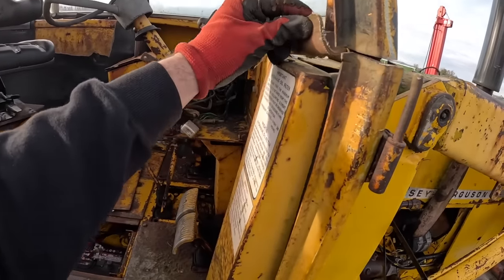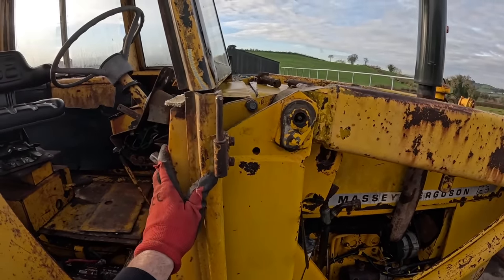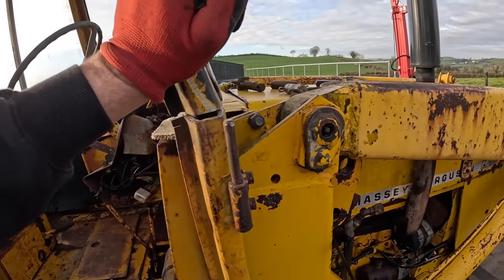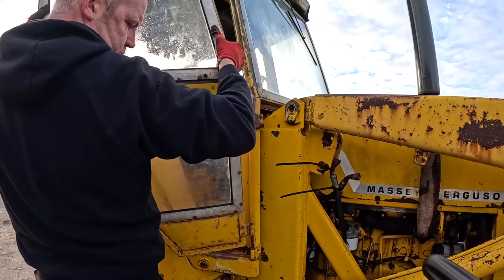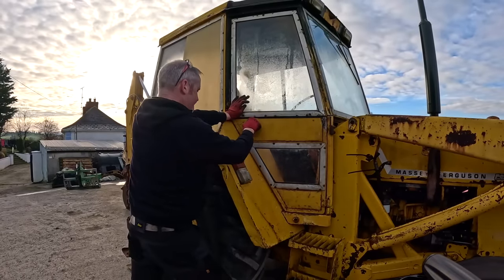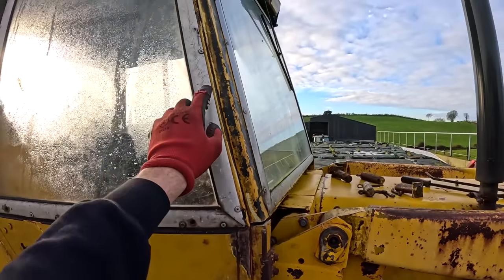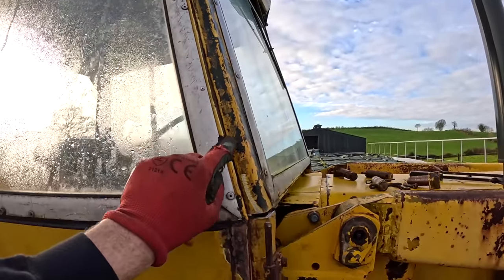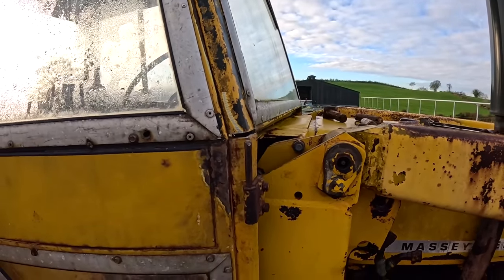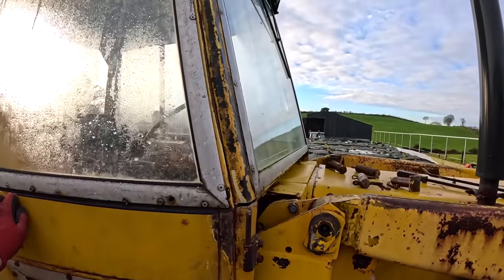I found this is probably going to be the easiest option and work out every bit as good. So this needs to sit there - that's what that frame needs to be. I'm going to put the door back on and just check it, and when we get the door on I'm going to move this out here as well and we're going to weld it into a new spot. Door should sit in now right. So the door sits in now, got plenty of movement there. What I'm going to do is put a screwdriver in here, force these two out so that they meet, and then use a wee bit of steel, put it into that gap, cut it to size and extend it, and that will hopefully leave our door so that at least it's in the right spot and it can close.